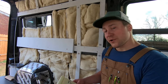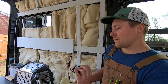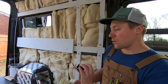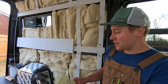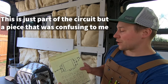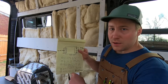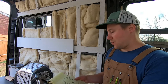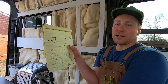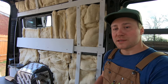When doing wiring, especially with three-way switches with a dimmer option, they have four different connections you have to figure out for matching up with the other switch. To use it by itself, just skip the three-way and use those three wires. I like to draw out a wiring diagram so I know exactly where things are going, then give myself steps for what to tackle first. That way you can get in, get out, and on with life. Without it written down, you screw something up — obviously that happened to me last night with the positive-to-negative mix-up. Definitely do diagrams or at least write out your process step-by-step.